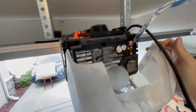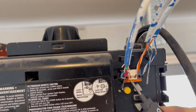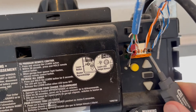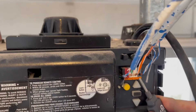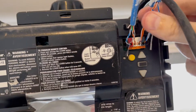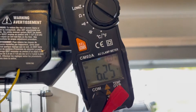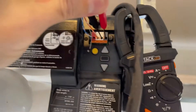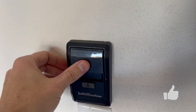So let's test it out. Remove the plastic shield cover, and here you will see a typical electrical setup for many garage door openers. The red and white terminals on the left side are for the control unit on the wall. The other two terminals on the right side are for the sensors. Press the release buttons on the bottom to release the wires one at a time. With the wires out of the way, check the voltage from the white and grayish-black terminals. If you still don't see about 6V, you may have to replace the receiver logic board. But since I have 6V here but don't have the voltage at the sensors, my problem most likely is the wiring. And if I install a new wire, the problem should be fixed. If you found this video informative, hit the like button and thanks for watching.